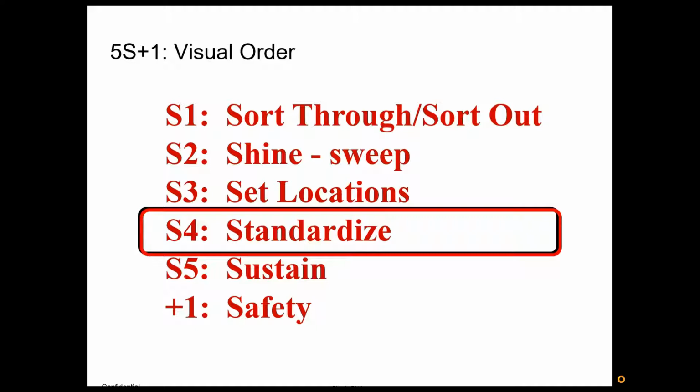Very important. Again, to the degree that you're able, you want the same standards everywhere. Use good color coding. In one of the factories that I helped to implement Lean in, we had color codes where if you saw a yellow line around somewhere, it meant that it was equipment that was staying, or a walkway. A green line meant it was something that was going to be leaving, like trash or supplies that were going out, as outgoing things. If you had a blue border around something, it meant this was for incoming supplies. It was stuff that was going to be used in that area.